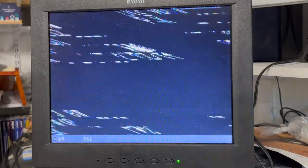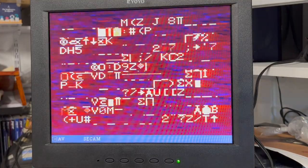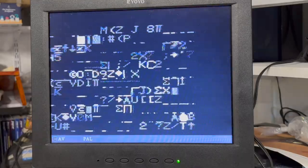Okay. So first power on, you get this garbage. Press the reset. It's always having to manually adjust the sync level. Doesn't like the sync level when you first start by the looks of it. Oh, okay. Interesting. Actually, let me disconnect that 120 picofarad.